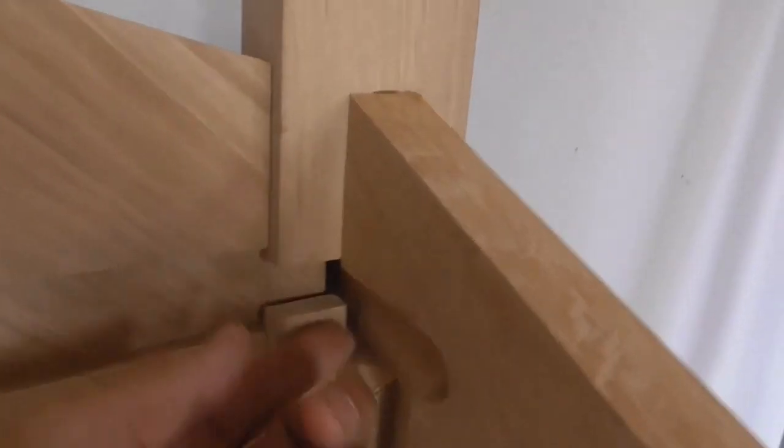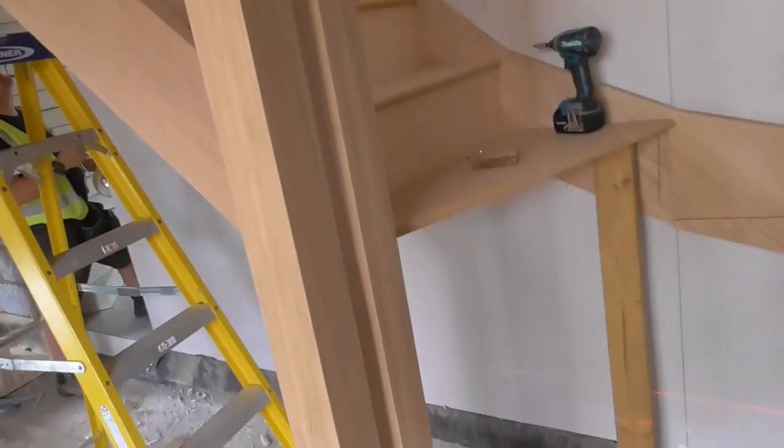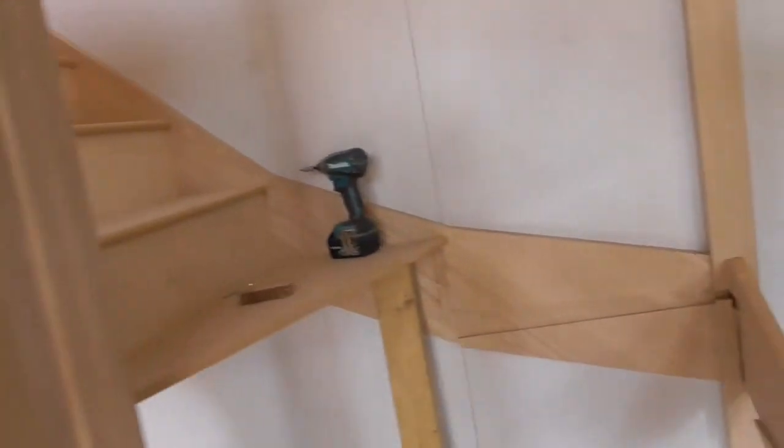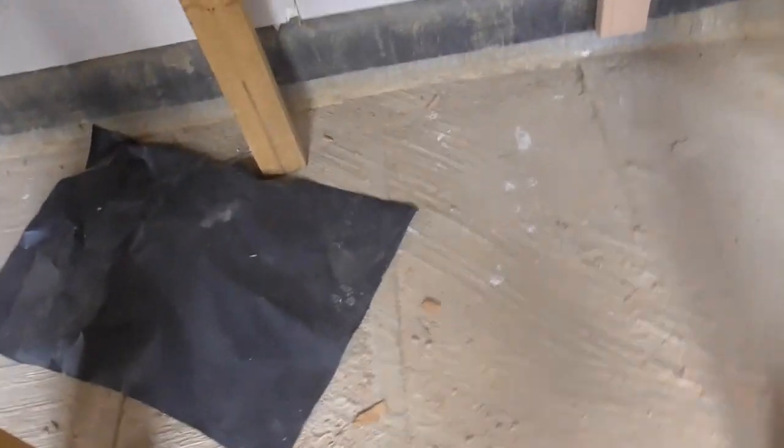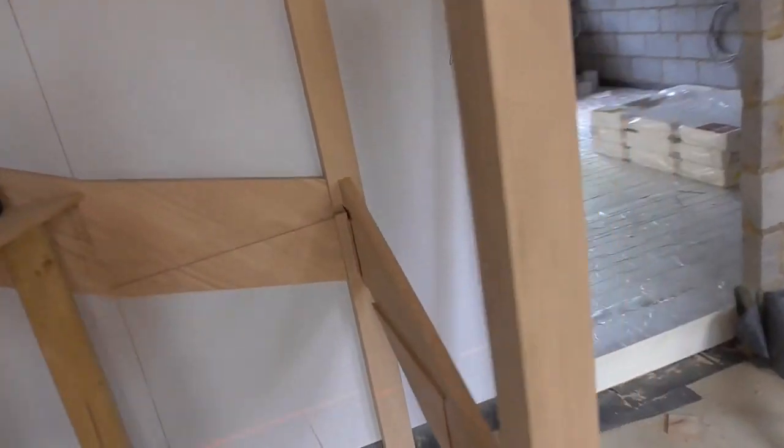This setup is all just mocked in here - it's not quite right but it doesn't matter because I'm going to fix it to the wall. That's just got to come up slightly but it's all looking like it's going to fit quite nicely. I've just got to work out my order. I think it's going to be this newel in first and that handrail. Then I'm probably going to fix this half newel into here through the face on the inside - which we won't see. I've got to be careful I don't make it difficult to get my kite winders in. Then I'll put this kite winder in, then the next kite winder and step, then this string on the end, and hopefully this bottom kite should slide in from the bottom, then the ball nose goes on the front. It's all looking good - not that much more work to get to the maiden voyage.